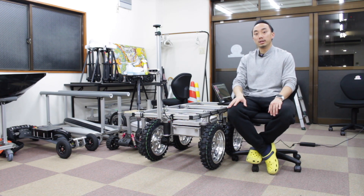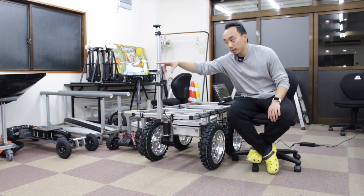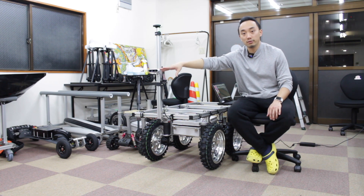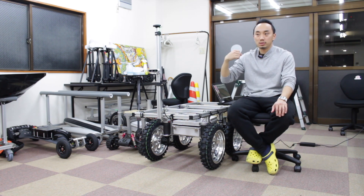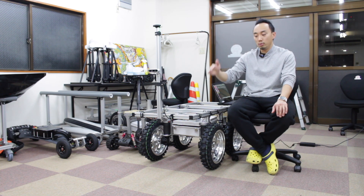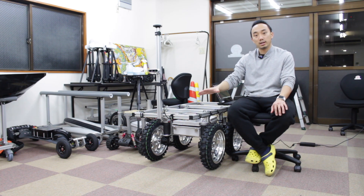The idea of this robot is it will keep following a human that it can detect in front, using the D435 Intel RealSense camera which can provide depth information. I apply a basic algorithm: when the object is far, the robot goes fast; when the object gets closer, the robot slows down. Once something is in the stop zone, no matter what the object is, the robot stays in place for safety.